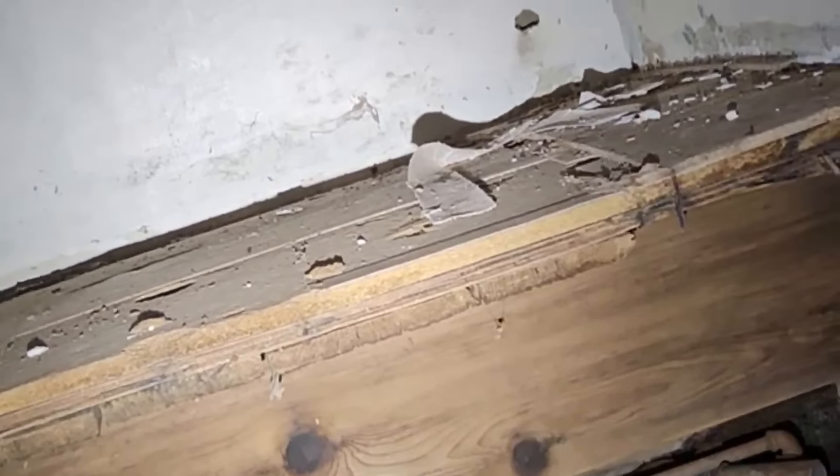We made it inside — we got rained on a little bit. We'll find out if it leaks. You can see all that water pouring down there. Remember when I was talking about how important it is to have gutters? All of that is coming off of the roof with no gutters, not being directed away from the foundation — soaking through the foundation, making the crawl space wet, encouraging bugs, causing rot of the end of the joists by sitting directly on the wet block.